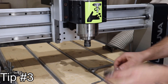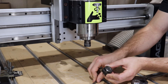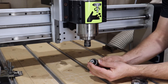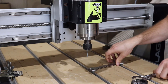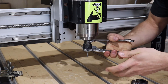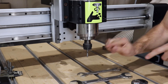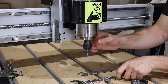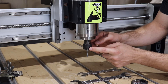Tip number three is how to properly tighten everything to your spindle. How you've been taught in the past is: put your bit in there, you're an eighth inch or three millimeters from the end, you put it on there, you get it hand tight, then you take your two wrenches and tighten it up till it gets pretty tight where your hands close together or you give it a little nudge. That way works until you start dealing with longer bits — it works with engraving bits, but when you start dealing with longer bits like a three-eighths or half-inch bit, that tightness does not work.